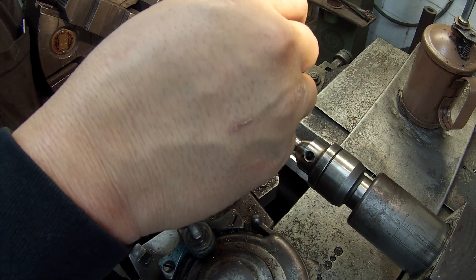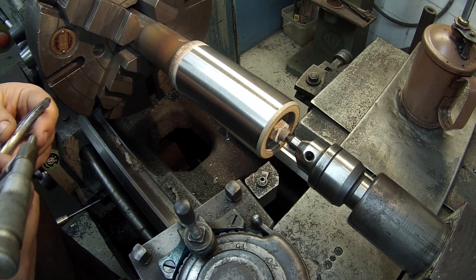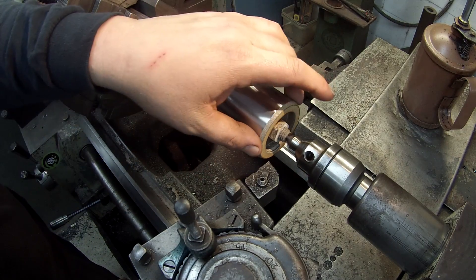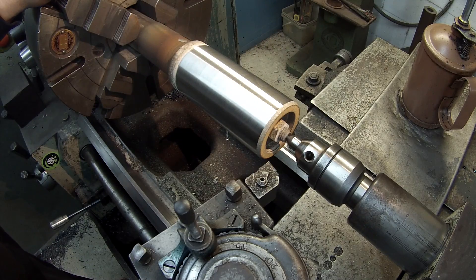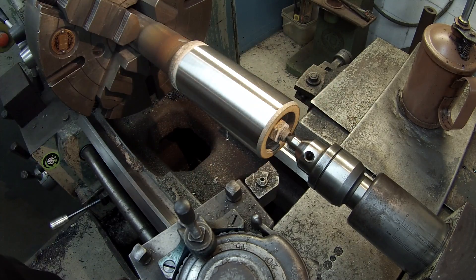Okay, so I've been getting about a thousandths taper in it — I'll just keep comparing the ends. We got 13 thousandths to bring it to two and a half here, so I'm going to dial in 12 thousandths and then we're going to do a polish on it.